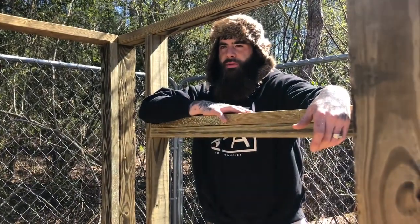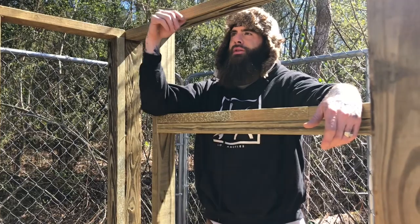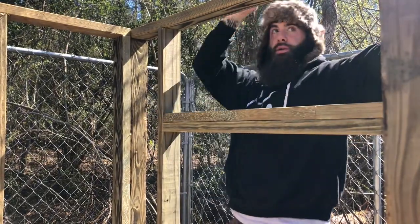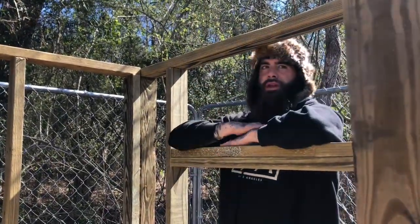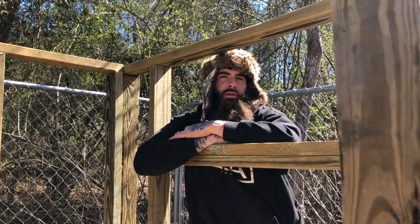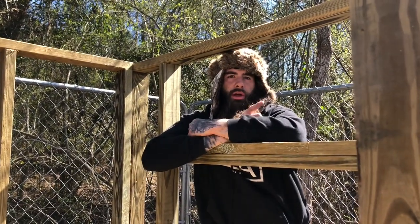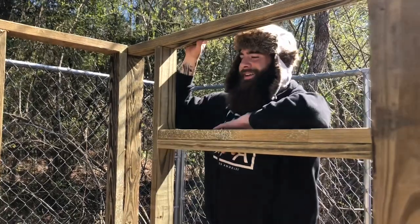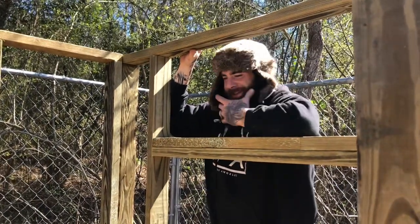It's not a perfect science but I was gonna put a couple of rafters across flat, then stick a two-by-four and cut it at an angle from one end to the other — so it comes in an angle all the way down — and then put the tin right on top of that so the water runs down. I could cut all these boards at an angle, or we could build an A-frame roof, but this is easy and simple. You cut one two-by-four in half and you get two pieces because you're cutting it from corner to corner. It doesn't have to be perfect — it's for chickens.